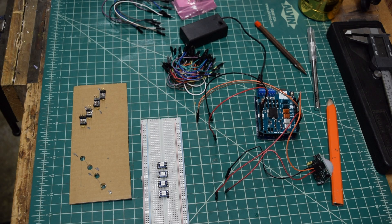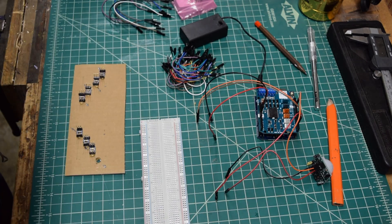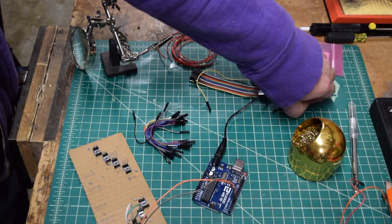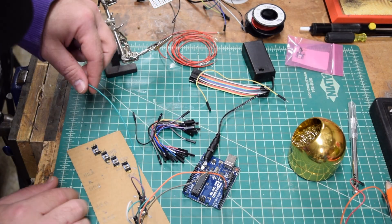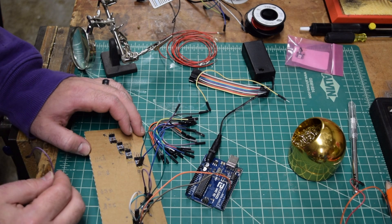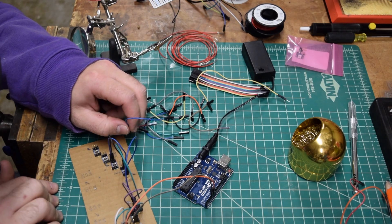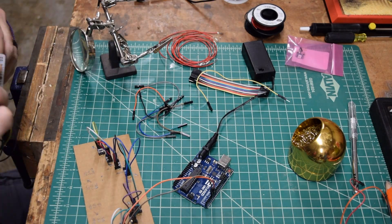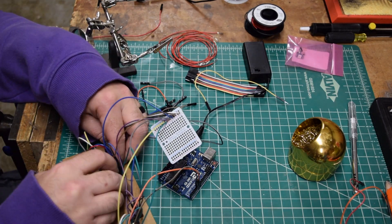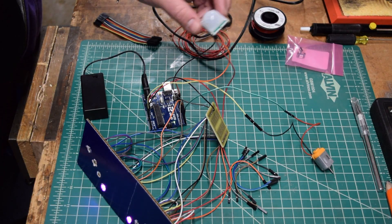This is because all the power was in parallel, but the data signal to control the color was in series. Chuck thought he could wire them all in series, but that was not correct. The LEDs weren't working correctly, and we figured out it was because Chuck changed his wiring scheme as he transferred from the breadboard to the backing cardboard, which we definitely do not recommend. After everything was put together, he re-uploaded the code and tested. Success!